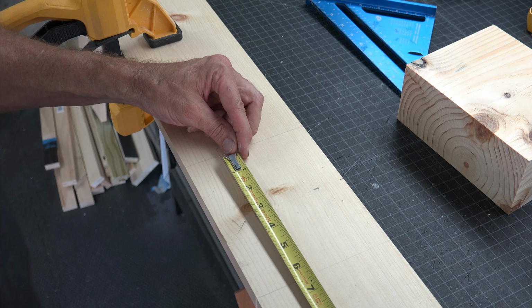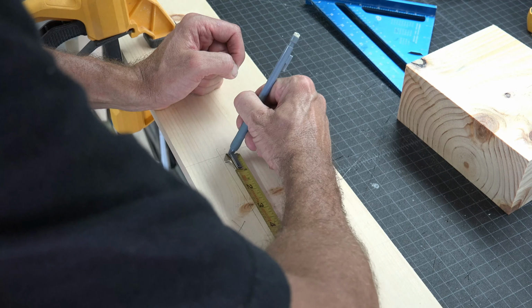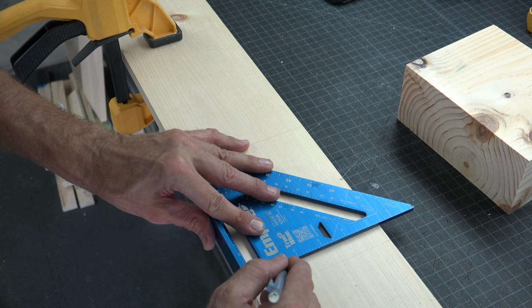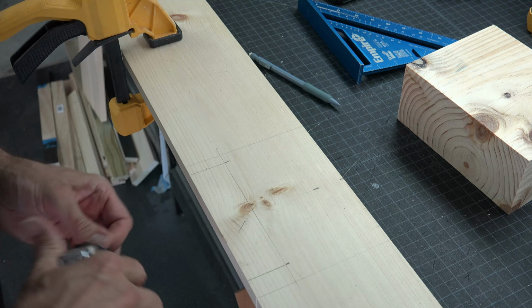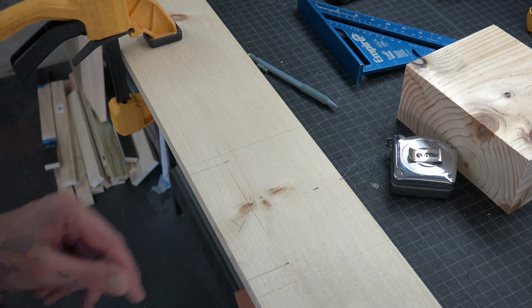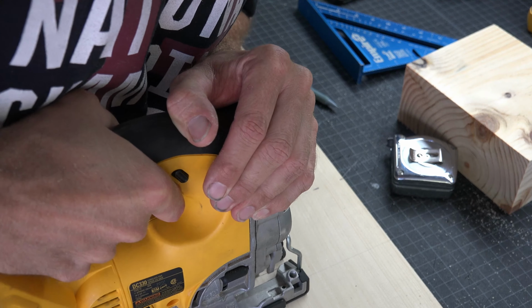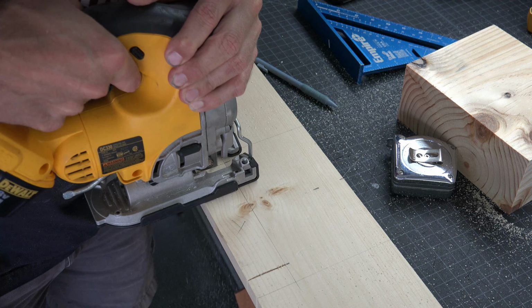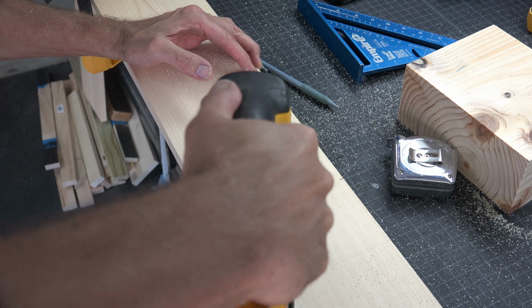To allow my cross pieces to share some of the same block, I will cut away a portion of the outer board where the block will sit. Find the center of your board and then use the block as a guide. Draw lines on your board to ensure you stay centered. Make your notch 6 inches wide. Your block should be 8 inches, so you still have support for a portion of the cut edges.